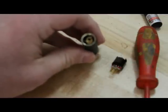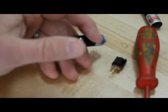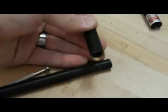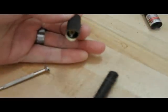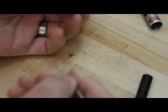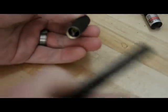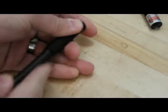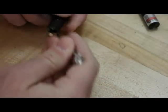If you look in here, you can kind of see where the button will drop out once you push it through. Go ahead and do that with the 0.4-something inch dowel that we cut. It's important to keep the button facing down so that it goes flush with the laser itself. If you need a little help, you can use a small screwdriver and push it down in there. Once you get it far enough so the spring is over the button, you can just pop the button out.